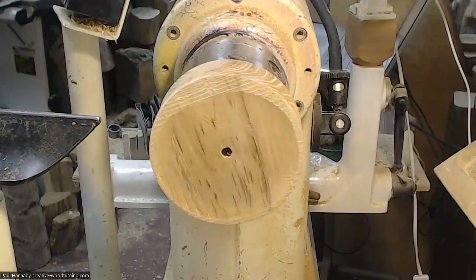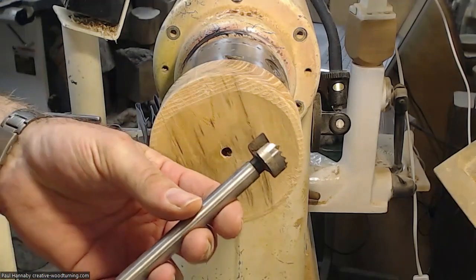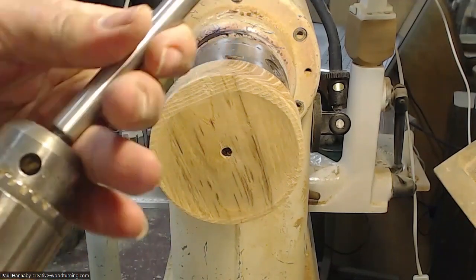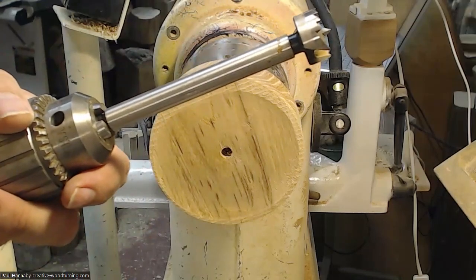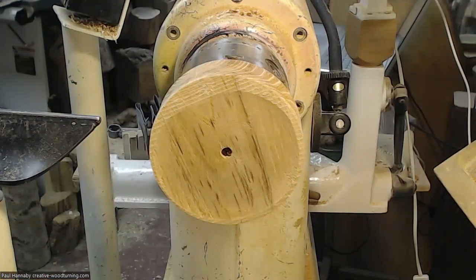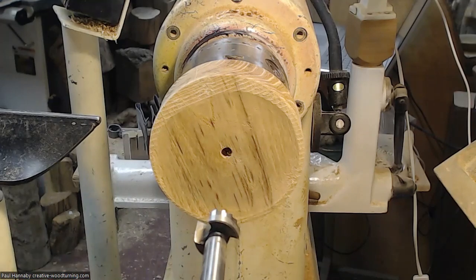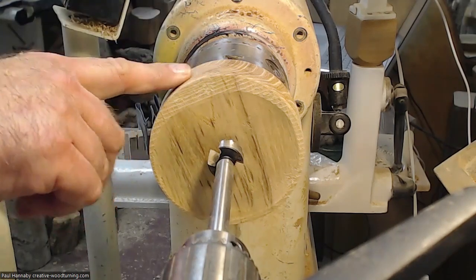And then to drill these, I've got a 1-inch Forstner bit. So that's how I'm going to drill my hole for the spigot for the top half to attach. And how we arrived at an inch, I looked at my spindles, which I think are about 2-inch diameter, and I thought, well, I'm going to shape it a bit, put a bead at the bottom, so I want to allow room for all of those things to happen. And really on a, let's say, less than 12-inch high candlestick, I'm sure a 1-inch spigot is strong enough. Now then, depth-wise,